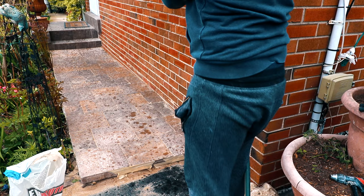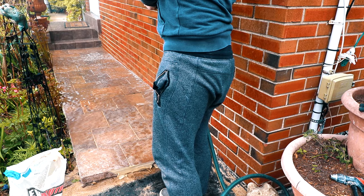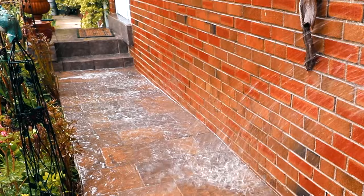Now that the pavers are done, the next step is to grab the hose and with a light spray just pour the water on. Within an hour you're gonna have a super dry walkway. If it's going to be raining, it's okay as long as it's not pouring — you want at least an hour to two hours before there's actually a downpour. You're gonna notice that it's foaming up a little — that's just the glue doing its job.